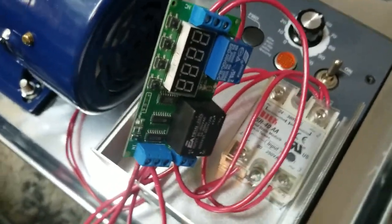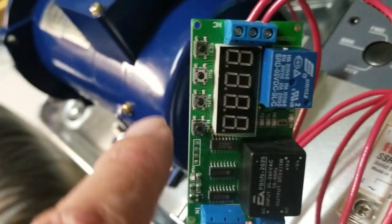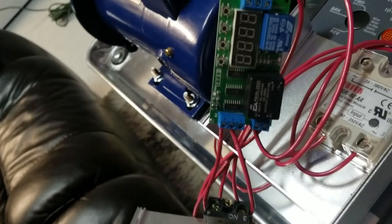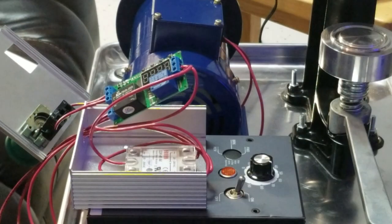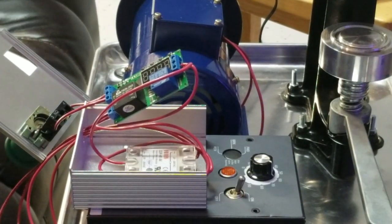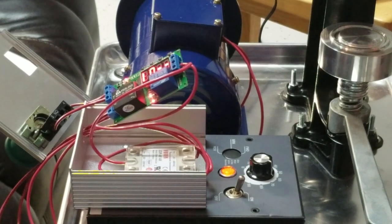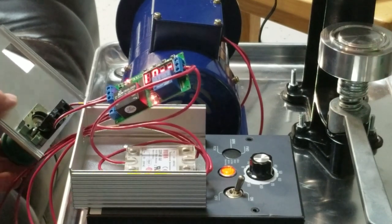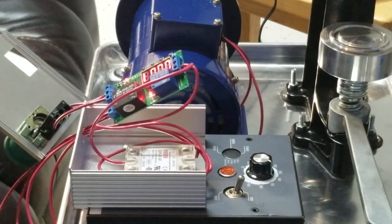The settings will be here, and there are three indicator lights here so I can set the mode on this time delay relay. So the moment of truth — we're going to power it on. Let's plug it in. I have no idea what mode this thing is set to, so there it goes. Looks like it's counting down to something. It's in a time delay on situation. When I press the momentary on switch, it's resetting the cycle, so I have to change the mode of that.